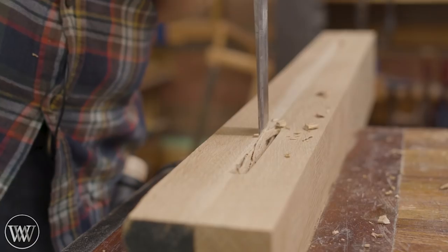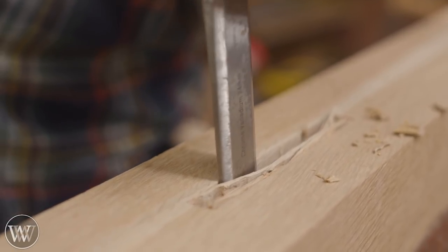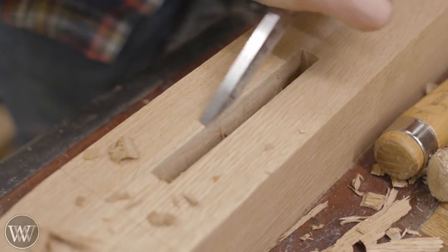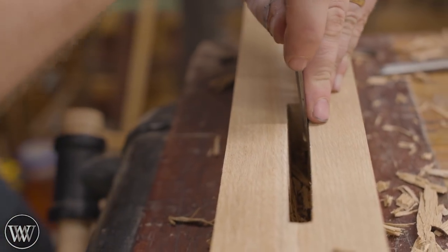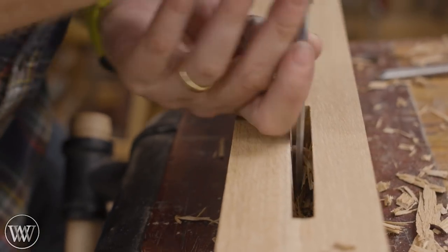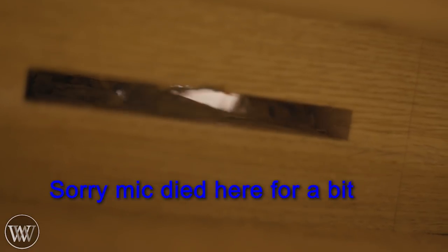Now we can come in and pare out. I'm going to get closer and closer to the line until there's just a little bit left, and pare it down right on that line, halfway down, then flip it over and do the other side. Take your time, do it slowly, don't rush it. If anything, stay away from the lines as long as possible, and then you can come in and pare it back to the line. If you're a little bit large down inside there it's not a huge issue, as long as your mouth opening is exactly where it needs to be - so I like to leave it a little bit large inside. Then I can come in and pare out the inside until I get a nice clean surface, and I can check that by putting the chisel in and sliding it around - that lets me know the mortise is the same width all the way across, and that chisel is the same thickness as my tenon.